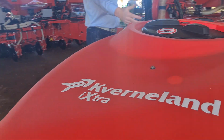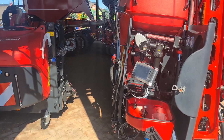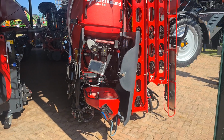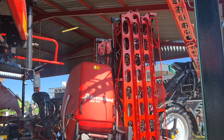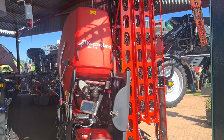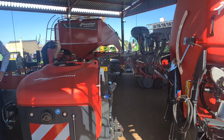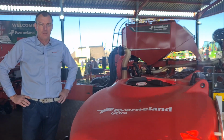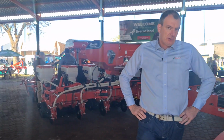Okay, so that's basically where this comes in. So we don't use a steel weight in the front. We take a water weight, a tank in the front where we put additional water, and then we don't have 1800 liters, but we add 1100 liters and we have 2900 liters in total on the combination. Okay, I hear you. But why don't I just go that route and just tow it behind?